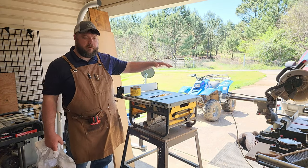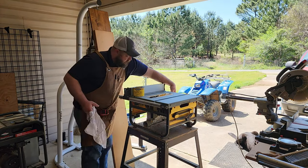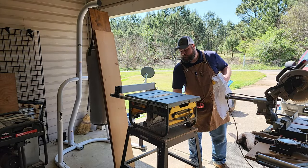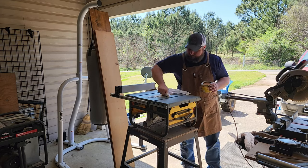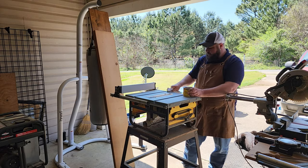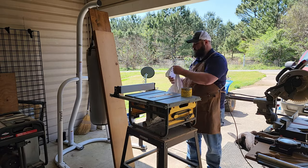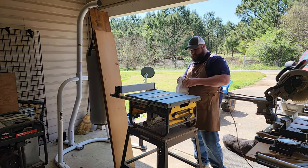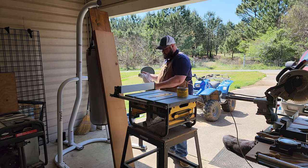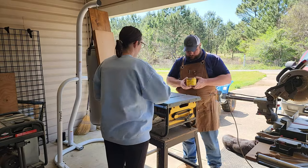I'm only putting it on the top here. So like I was saying, we're going to wax this with the Minwax. You want to brush it off and get all your dust off — that's where one of those cheap bench brushes comes in real handy. Just apply your wax like you would any other type, wipe it on and then buff it back off when you're done. It really makes a huge difference in how easy your wood slides over the table saw surface. I also like to protect my equipment with wax when I'm done — when I put it up and cover it with a tarp, I'll wax it and leave the wax on without buffing it off.